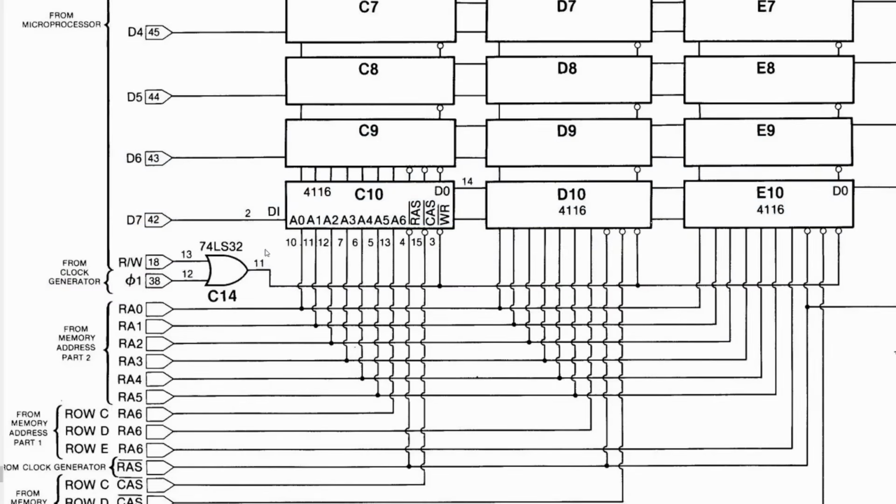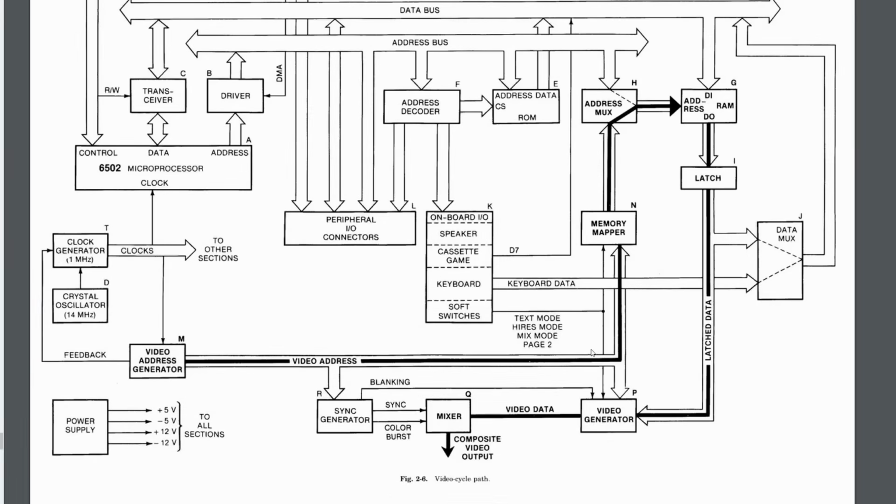So when that RAM chip was outputting a high signal, or 5 volt signal, that gate that drives the write signal that goes to the RAM had no trouble pulling it down to ground. Now, we weren't seeing any visual artifacts of it writing to memory, and I think that was very specifically because that write signal is happening in the off cycle from when the display is reading the RAM out and showing you what's in the contents of the RAM.